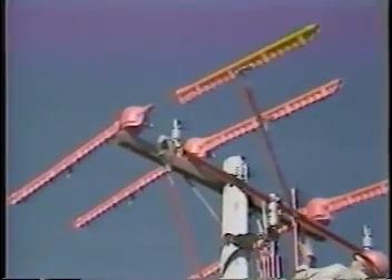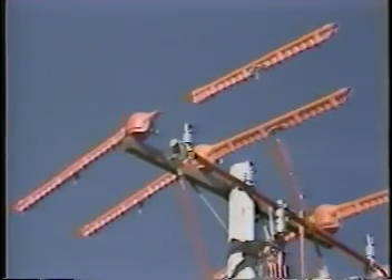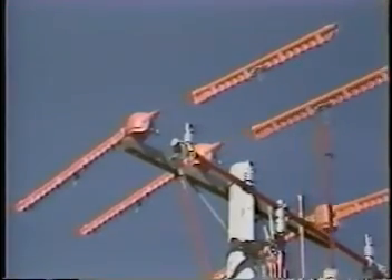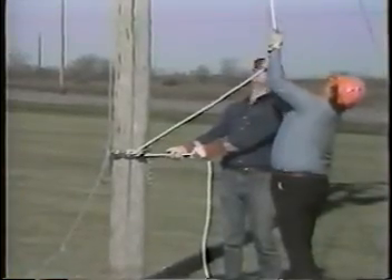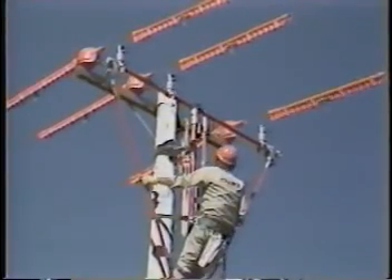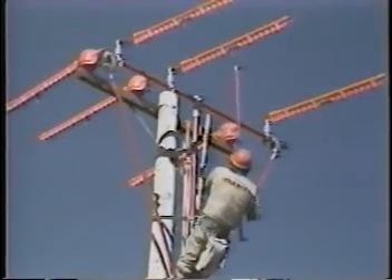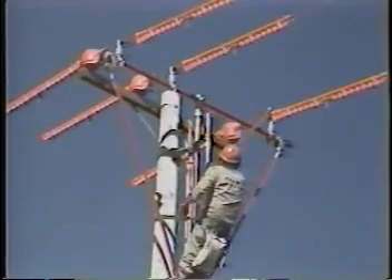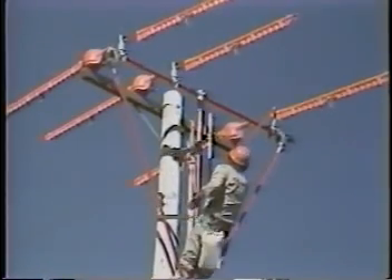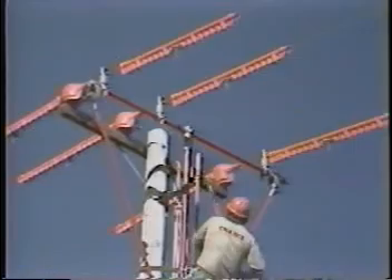Attach the blocks to a sling clamped in the base of the mast pole. On the auxiliary arm side, pull the conductor covers back approximately 30 inches from the insulator covers. Take up just enough strain on the blocks to make the wire holders lift all three phases approximately two inches. You need to do this so the phases will float or raise clear of the insulators when the tie wires are removed later. Make sure the wire holder latches are closed on all three phases.